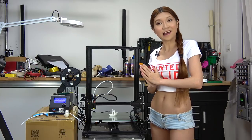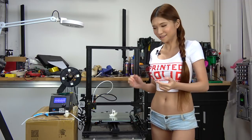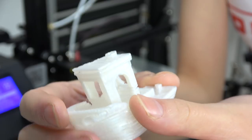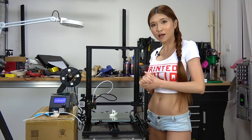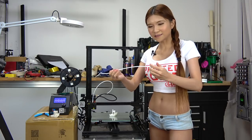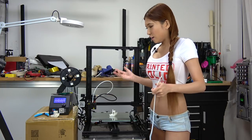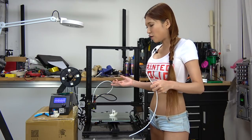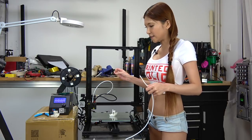We have a little bit of an adventure. Let me show you what the first print looks like — it looks pretty bad. I found out a problem: the Bowden tube was kind of bent in shipping and it wasn't fitting in the connectors properly. There was a spare one in the box, so I took it out, put it back on, and this time I checked it — it's locking the connectors firmly and it is seated properly.